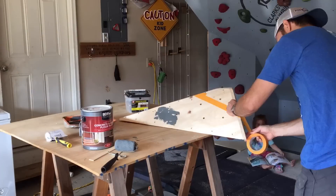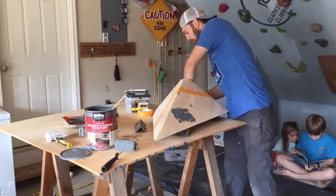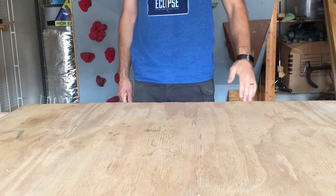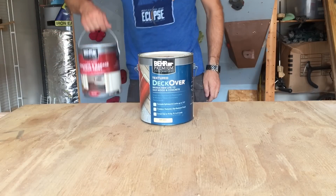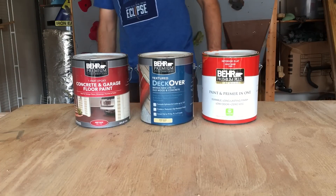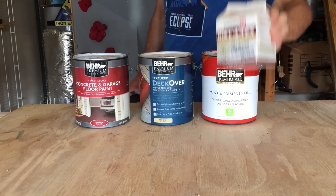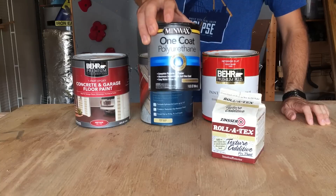Now that your volume is all smoothed out, it's time to paint. I wasn't able to get video of painting the pentagon, but really all volumes paint the same. There are many different things that you can use to cover your volumes with, but I like to keep it simple with some readily available paint. Deck Over is a good choice — it comes pre-textured — but you can also use other paints. I like to use the Behr Paint Plus Primer in flat. If you're going with the untextured paint, you also need to add a sand additive to your paint. This right here is key: a water-based clear coat. If you are going with just a regular paint, you need to have this as a finished coat.